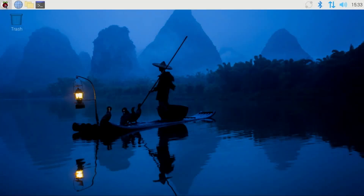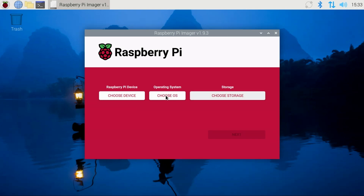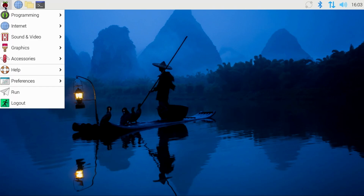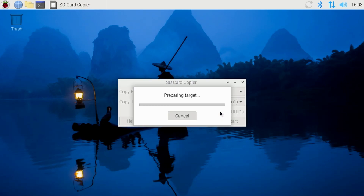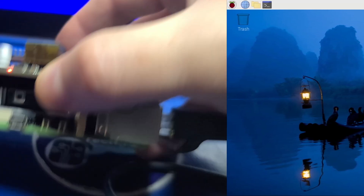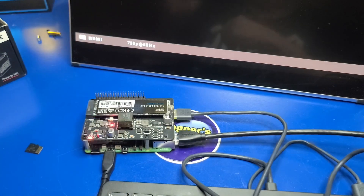If you'd like to install a different OS to the NVMe drive, you can use Raspberry Pi Imager to download and install it to the drive. Also, if you'd like to clone your microSD card to the NVMe drive so you don't need to go through setup again, under Accessories click the SD Card Copier application. For the 'Copy from Device' option, select the microSD card, which will include MMC in the path. For the 'Copy to Device' option, select the one with NVMe in the path, then click Start. Once the copy is done, close the SD Card Copier, shut down the Pi, remove the microSD card, and when you press the power button the Pi will now boot from the NVMe drive.